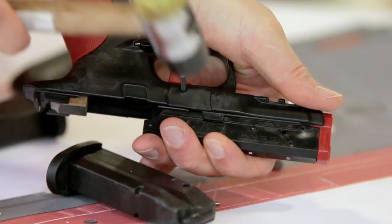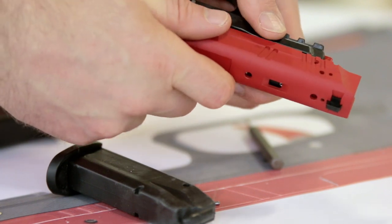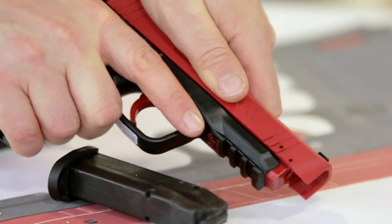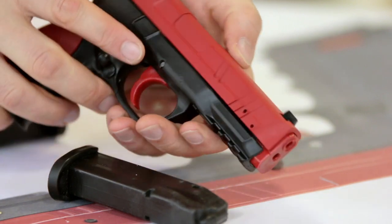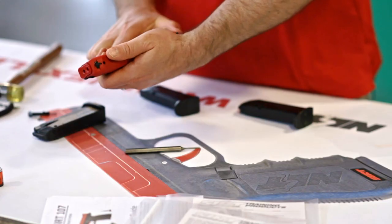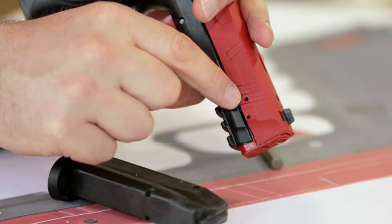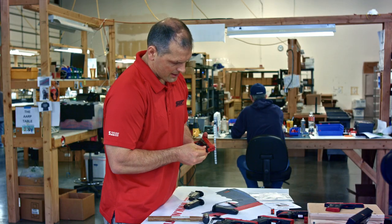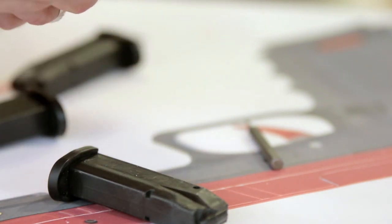We can pop this pin in, then bring the slide back on — slide comes over like so — and then slide it back, just kind of massage it in. Now don't forget the pin. It's pretty snug and can sit there, but there's this one front pin, so you want to bring it forward. Keep your eyes on this hole right here and move the slide forward and aft with respect to the frame until it's about centered up and you get a good clear visual through the hole.